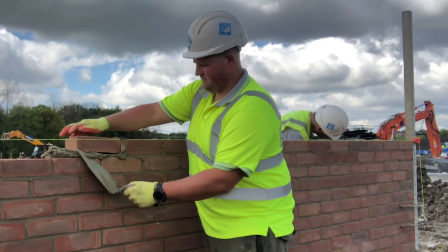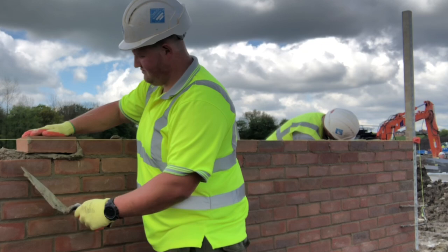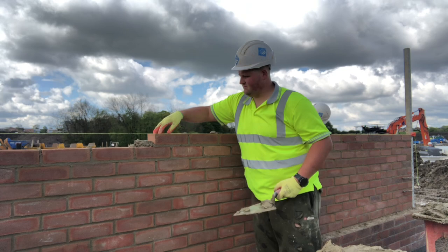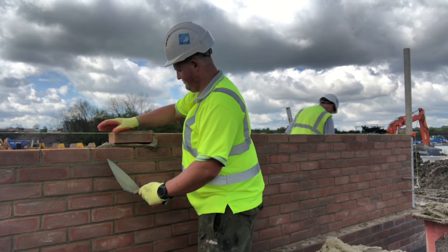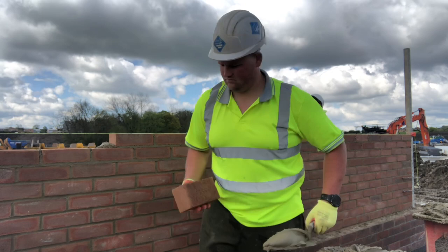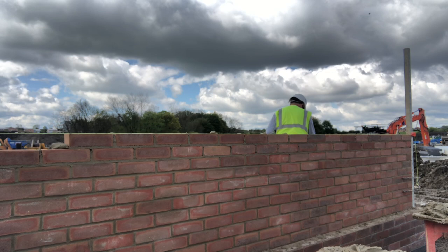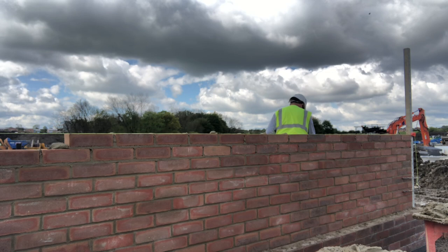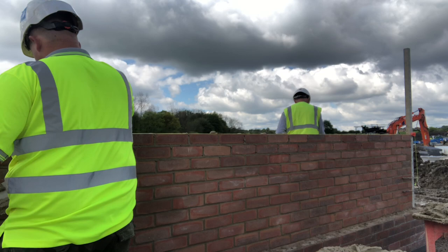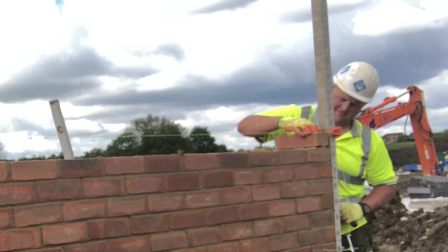So I'm going to experiment a bit more tomorrow. I covered the bricks — just in case it rained overnight. The old saying is you can put water in but you can't take it out. If it rains tonight the bricks will be nice and moist. If I could get my bricks just a little bit wetter it makes the build so much easier. Sometimes in winter I've got more done some days than in summer — obviously on average you don't because the days are shorter, it's dark by half three or four, and you can lose an hour or two on a morning to frost, or you're getting rained off regularly.